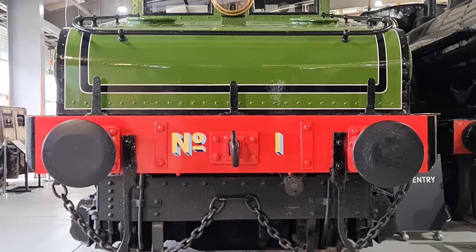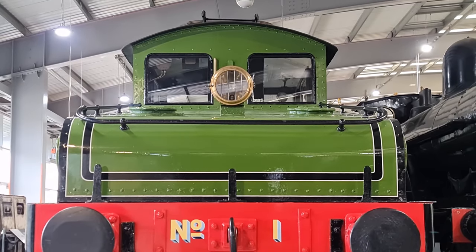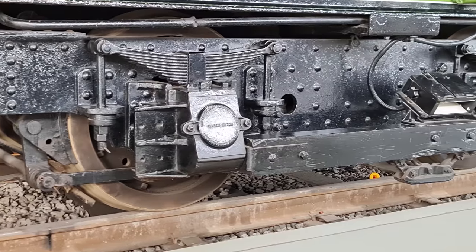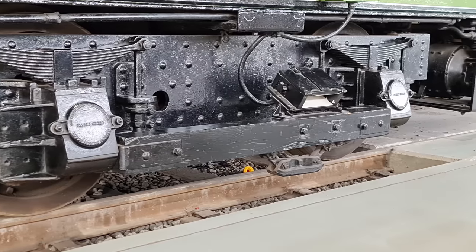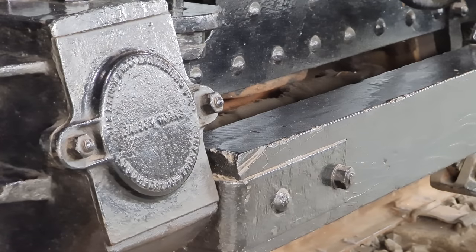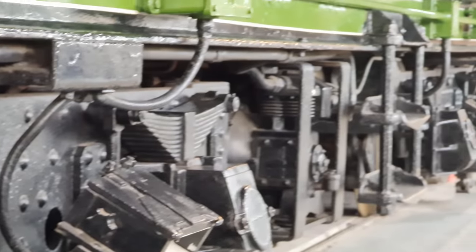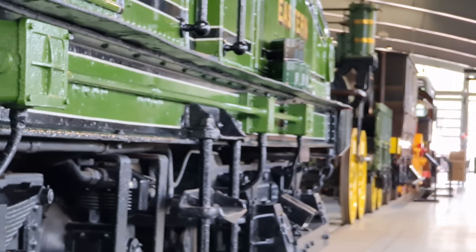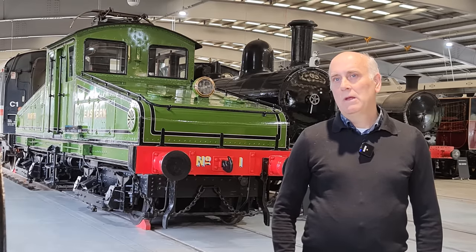Well, back in 1905, electrification was just starting in the UK. You'd only just opened the Lancashire and Yorkshire electrification between Liverpool and Southport, and of course the Northeastern electrification around Tyneside. And Merz, Charles Hesterman Merz, of course based on Tyneside, persuaded the Northeastern general manager, Gibb, to electrify. So it was obvious that the other thing you needed to look at was how you dealt with things like the Docks branch as well. And they looked at that, and it's 630 volts DC. So it was really ahead of its time.